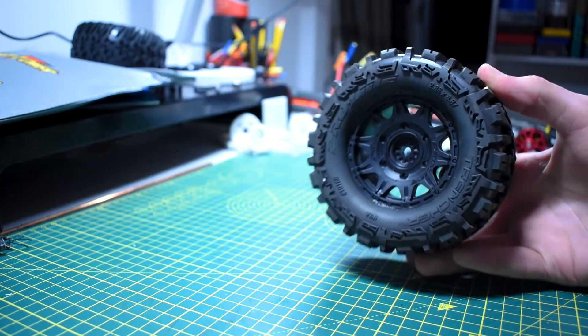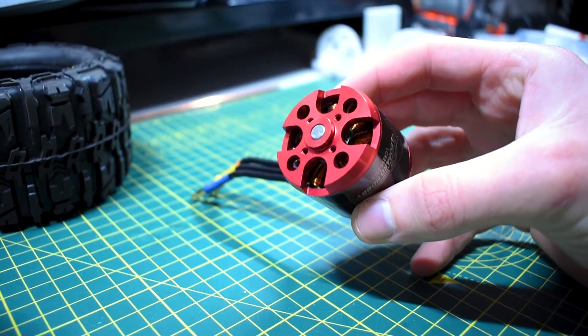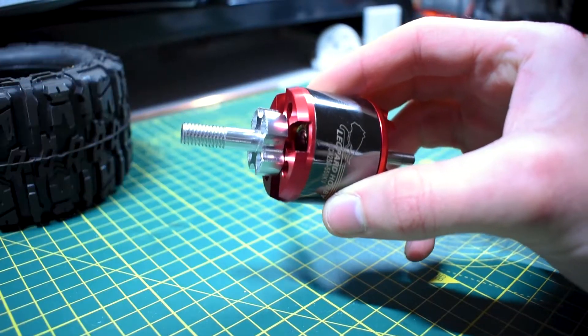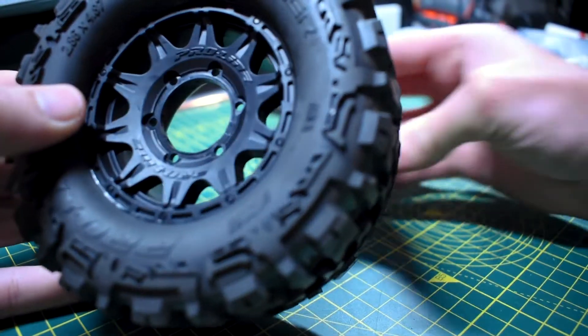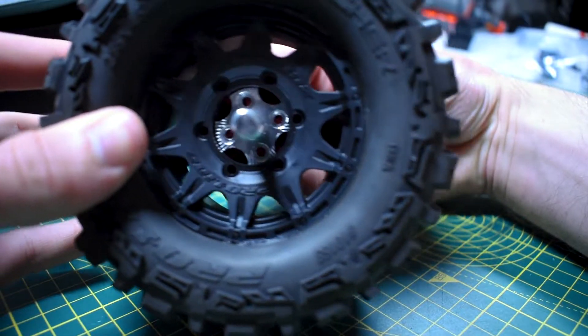This is actually very handy because I'm going to have to design my own. If you remember from before, my motor has this little fixture that attaches to it and it basically allows you to couple to the wheel using these four bolts. So I'm going to have to design my own little attachment piece that I can bolt to the wheel and the motor.